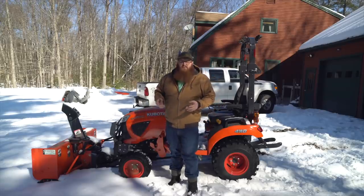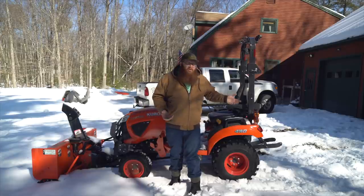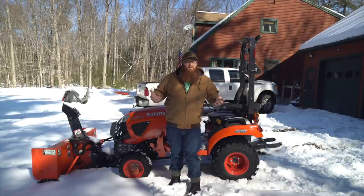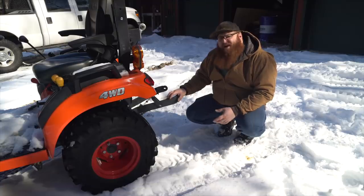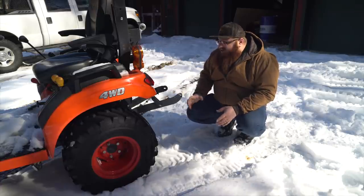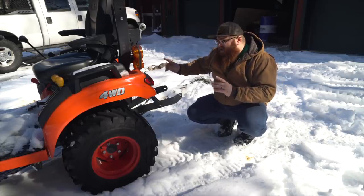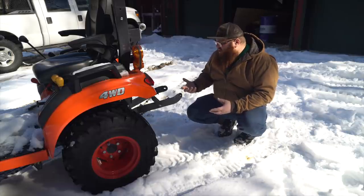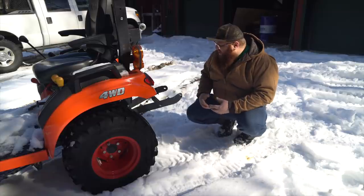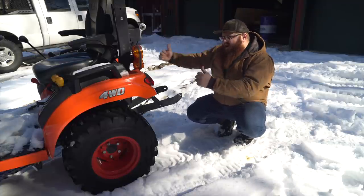The two main types of snowblowers you're going to run into for small tractors are front mounts and rear mounts, also known as three-point mounts. There are some situations where front mounts are going to be better and some where rear mounts are going to be better. A rear mount or three-point snowblower mounts to the rear three-point hitch on your tractor. There are two main designs: one is the pull type, where the apparatus sits further out and you drive forward while it shoots snow to either side like a big scoop. The second and most common version is your standard rear-facing snowblower, where you need to back up down your driveway or sidewalk — the tractor has to go backwards.